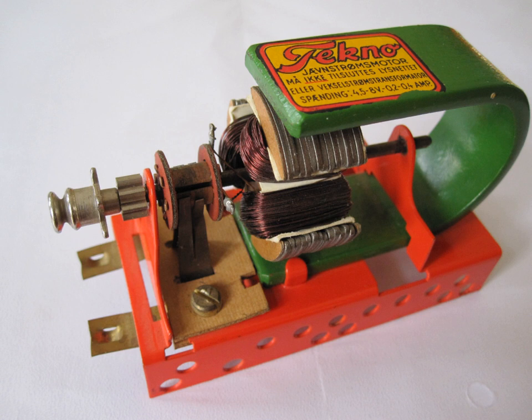The bipolar motor is still in widespread use today, in medium power, low-cost applications such as the universal motors used in home appliances such as food mixers, vacuum cleaners and electric drills. These motors are broadly the design of the brushed DC motor with series connected field windings. They also work well on AC supplies and are now most commonly found on such. They offer greater torque and speed than induction motors and so have many applications where their capital cost and light weight are more important than their electrical efficiency.